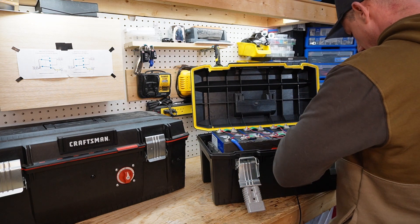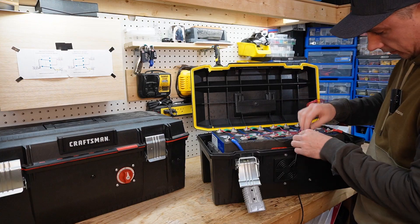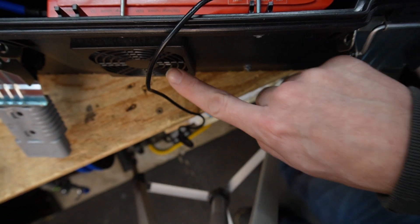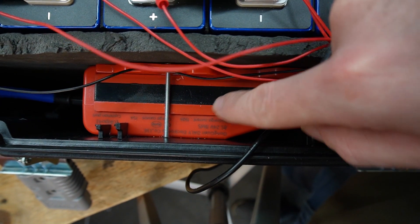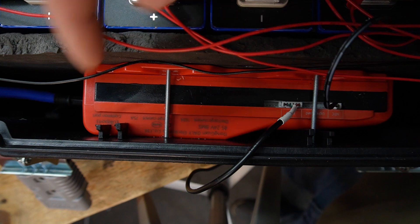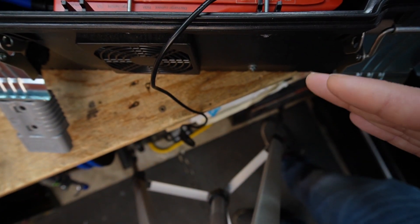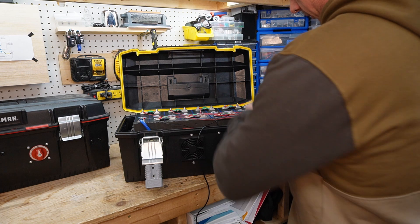Let's start out with getting to the balance cables — I have those disconnected now. Right here I have a DALI BMS and this is the one that has a fan blowing out. I put a fan cover on the front exactly where the fan is, so if it ever turns on to dissipate heat it'll blow directly out of the box, taking the heat from inside and forcing the air out. It never actually happened, but I designed the box to handle that just in case.